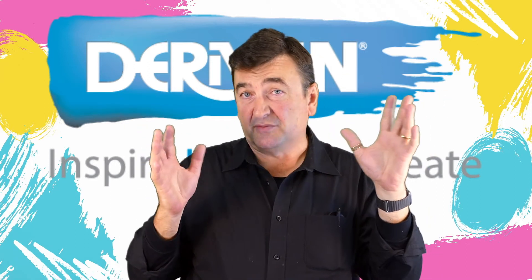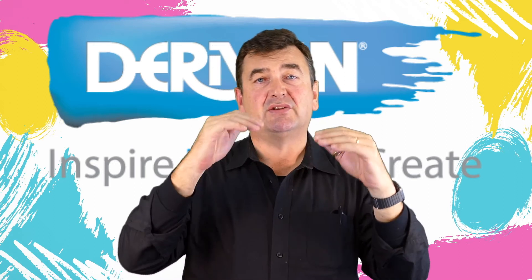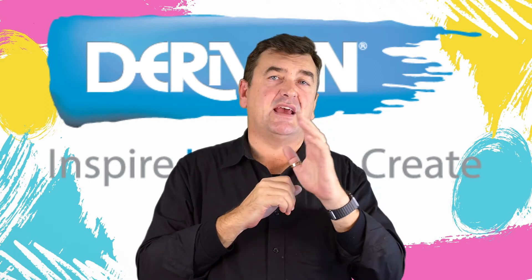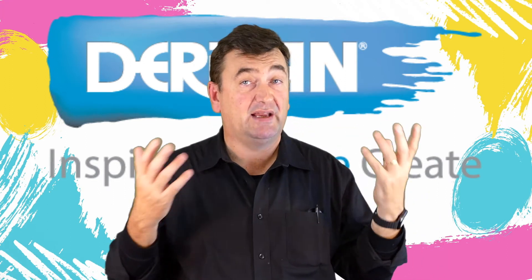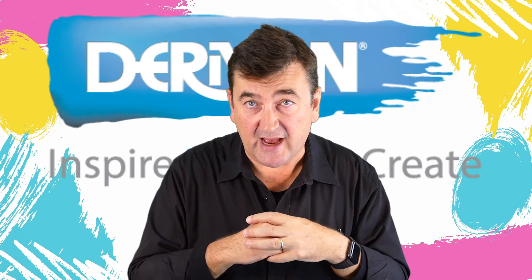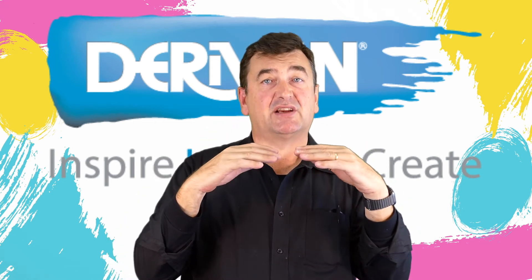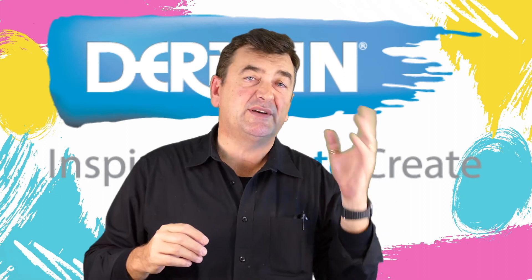Are there other problems? If you put coats on really thick and don't leave enough time to dry, you risk cracking caused by the difference in drying times between coats. For instance, if you put on a very thick coat — literally several millimeters — and then after only an hour or two it has a skin, and you put a thinner coat over the top, that thinner coat will dry more quickly and become rigid, while the coat underneath is still shrinking as water escapes. That movement can cause cracking.